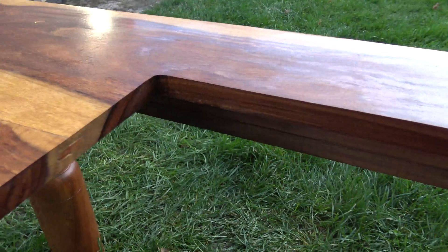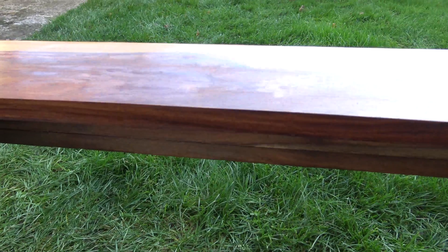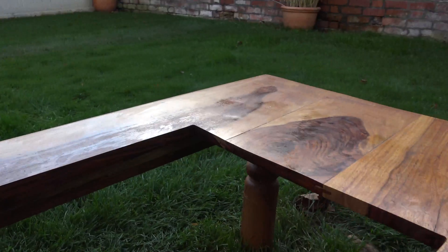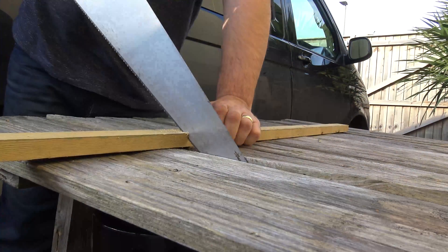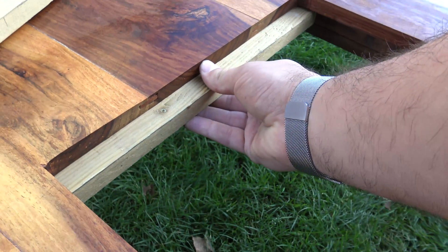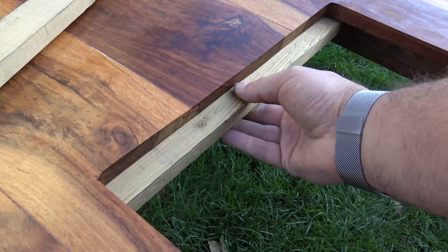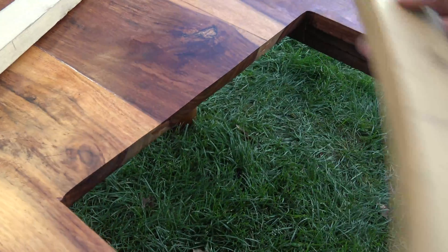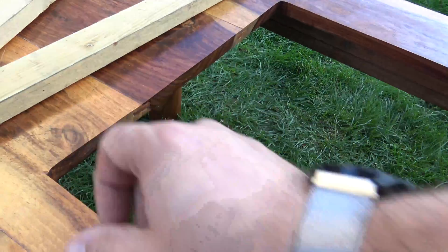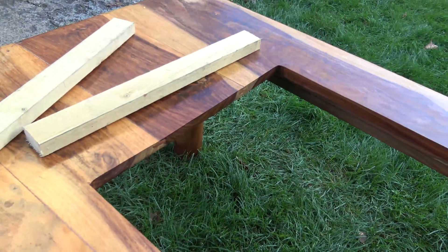So I put a little linseed oil on the fresh cut and you can't even tell where the fresh cut is now — aside from the gaping hole in the table. What I'm going to do is attach a couple of battens underneath the table like that. That should then give the monitor — the LG monitor — something to sit on, and it should also improve the structural integrity of the coffee table now that I've chopped it up.